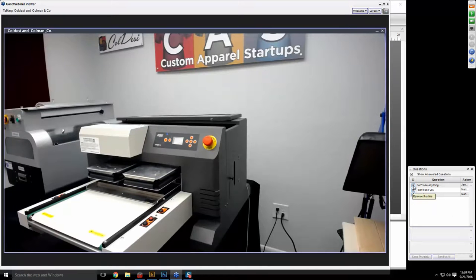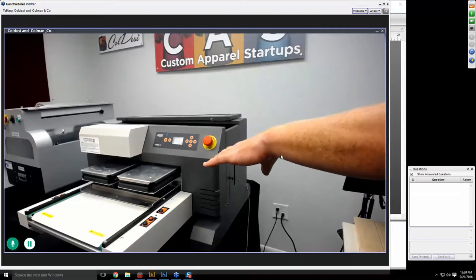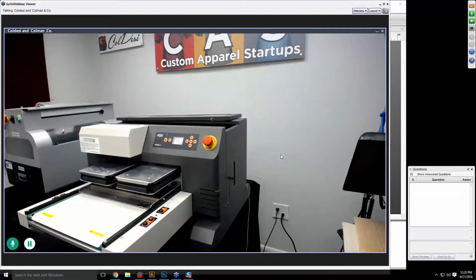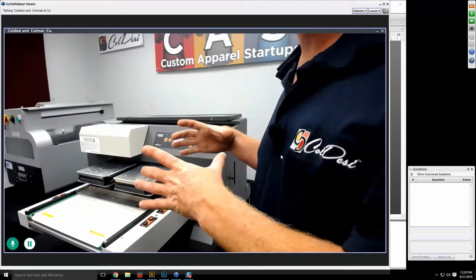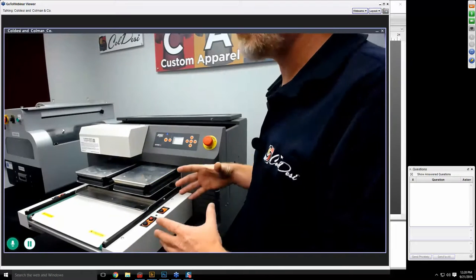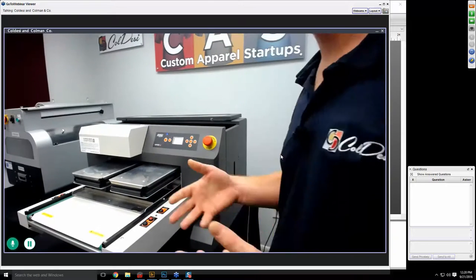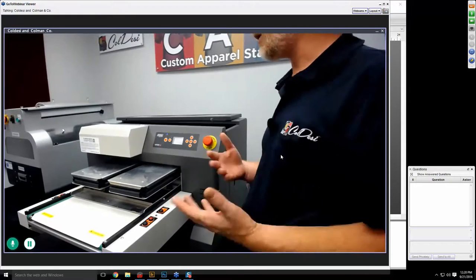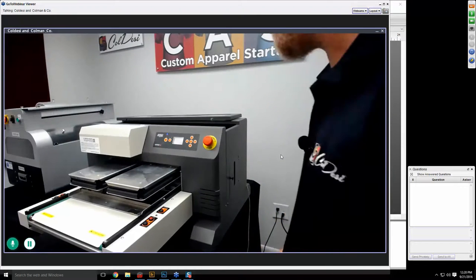So, with this technique that I'm showing you and how I created that template for this irregular shape, say I was printing a mouse pad. Instead of using the measurements for that, I would measure the mouse pad and print a square directly onto the platen at the size of my mouse pad. And then when you see me import the image on top of it and print it in the exact same place, you can use that technique for all kinds of different weird objects and stuff. So it's an easy way to control where the placement of your image goes.